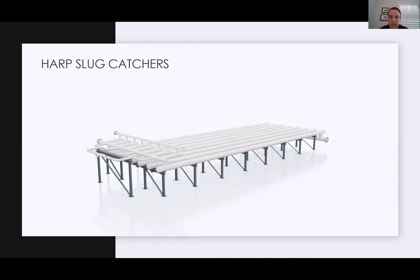The top fingers here on the left-hand side, you split into your inlet header there. On the top, you have the short little separation fingers. Those are acting as horizontal vessels, right? That's where your slug rolls into. It levels off and then it drains back down into your downcomer, which is the small piece connecting down into the storage tubes. Typically, the separation tubes are angled up and the storage tubes are angled down so that your liquids flow, in this case, to the far end of the photo where your liquid manifold is. Your dry gas would come out the top in that small manifold at the top there. So hopefully everyone has an idea of the pieces of that slug catcher.